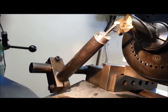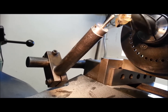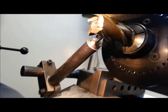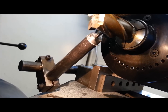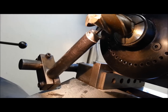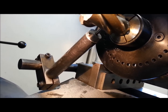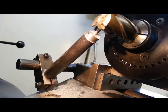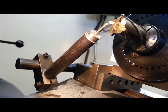After you get back and out of the way, turn it, bring it over to the next flute, drop it on the pin and roll it in. Right now I'm pulled away from the grinding wheel so it wouldn't hit, so I could demonstrate this. I've got it set up so it comes to a stop — there's a stopping collar at the back, so you just turn it until it bumps and stops, and your grind is finished.